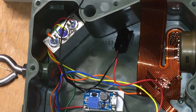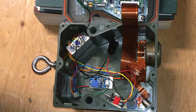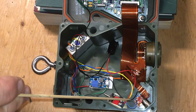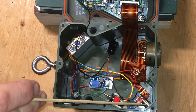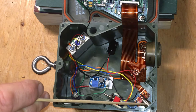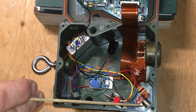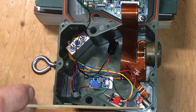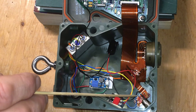Let's zoom in a little bit. Over on the lower right, I actually added a coaxial connector for a power supply — basically a 5.5mm by 2.1mm coaxial jack — so I can power it from a 12 volt power supply. Positive voltage comes in off the center pin.